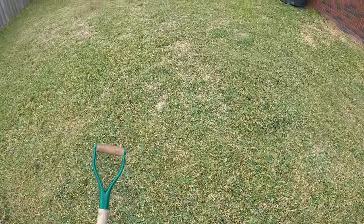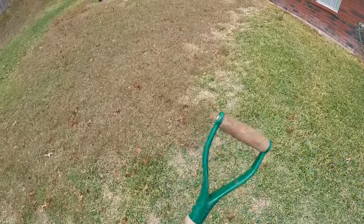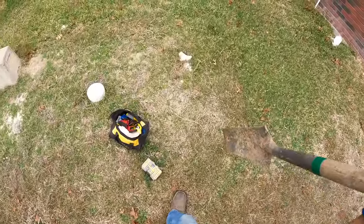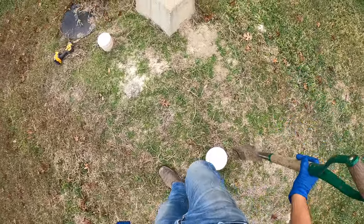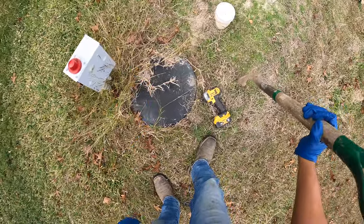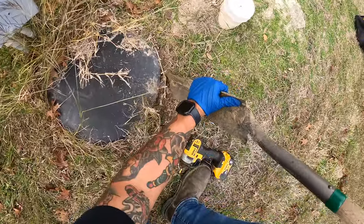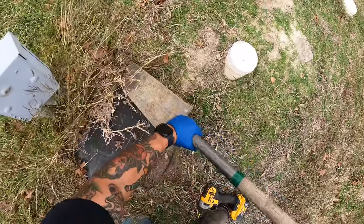Time to go fishing. These aerobic systems — the way they work, everything flows from the house into the tank and it's split into three compartments. We've got the sludge chamber right here. Not sure why they didn't put risers. Here's the aerator, and then this is the pump tank. If this light was on, that'd be telling me there's a problem with the pump, but sometimes the bulb goes out and the alarm doesn't sound. I'm gonna dig this up just to make sure, then open up the sludge chamber — I'm guessing that's going to be the issue.